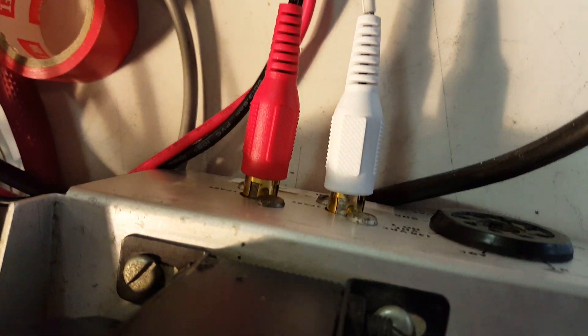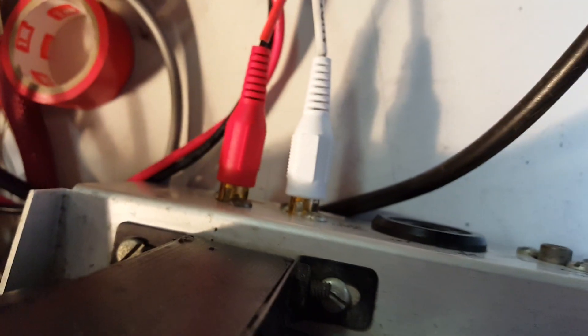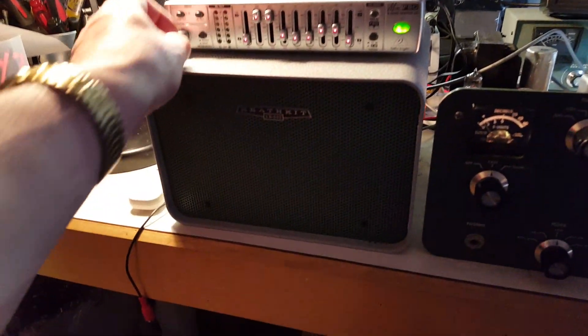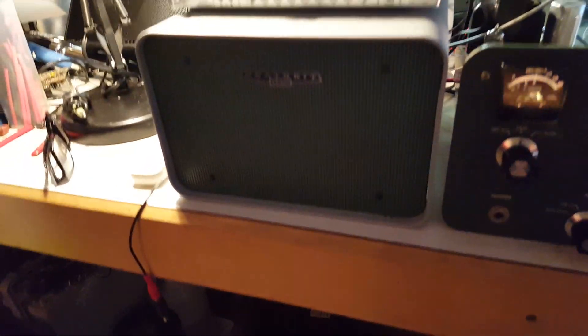This all comes from a simple little modification on the back, where I have added a detector out and amplifier in to the receiver. I'm coming out of the receiver into my EQ unit.